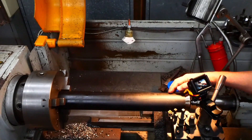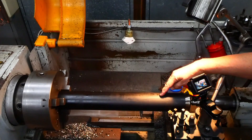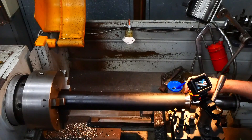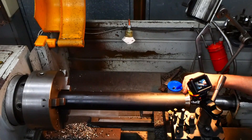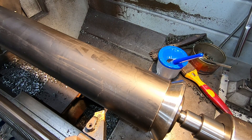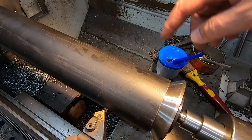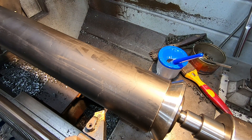I've got this piece of tube — it's described as 65 nominal bore but the OD is 76.2mm and I want it to be 76.15mm so I'll get a sliding fit inside the bore of the chuck. I want to take a piece about 60mm long, then we'll touch off at 62. Once I've got this piece to about the right OD I'll just be hacking it off and then finishing the machining directly in the chuck.